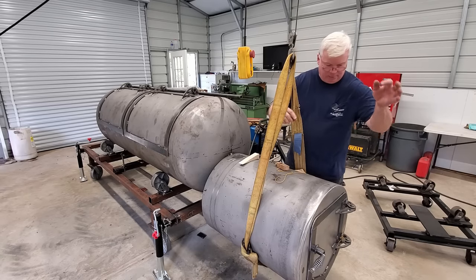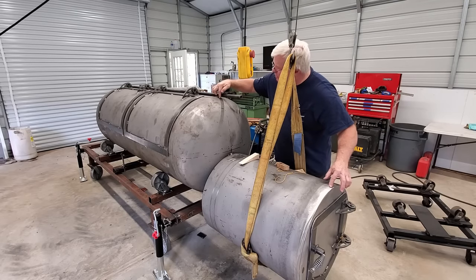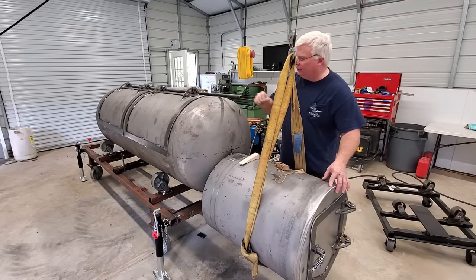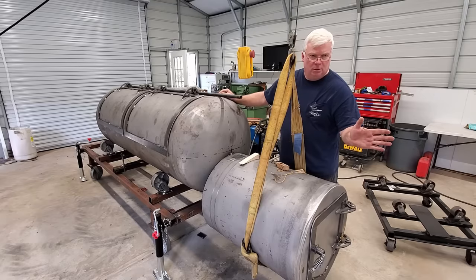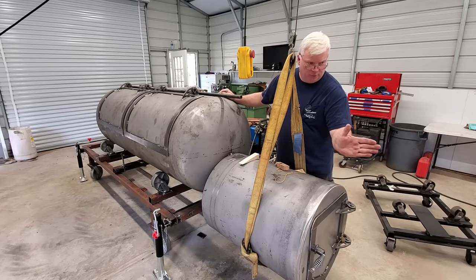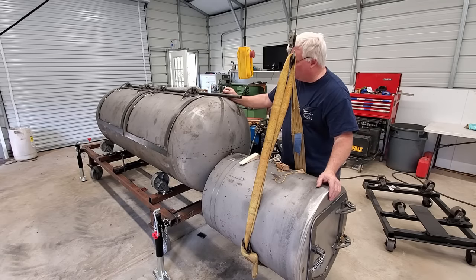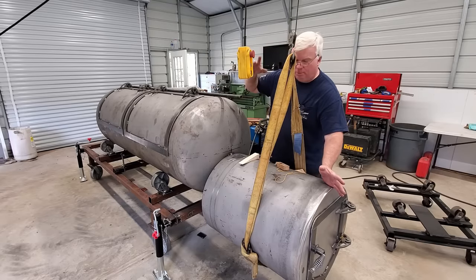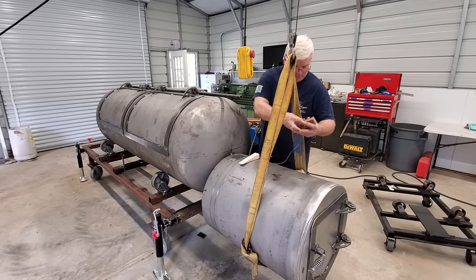And we want to be able to hang this plumb bob right down through the center of that line. But we want to make sure that it also extends off of this line. Well, darn, our hinges are sitting on top of that line, so it would be very difficult for us to extend that line directly out. Now, for a while I toyed with doing it with a laser, but that got cumbersome because you can introduce some errors. If your laser is not exactly in line with the tank, then you can have some problems that you're not really recognizing right off the bat. I have found that the best way to do it is just hang a plumb bob, extend it out, and what we're going to do to make sure we get over our line is very simple.